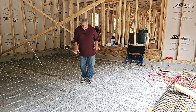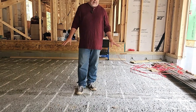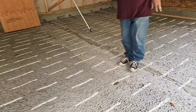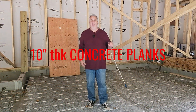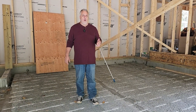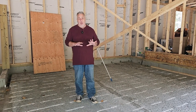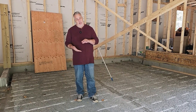You can see this is a very rough concrete. If your concrete guy gave you this as your garage floor, you'd fire him in a heartbeat. But that's because we're not quite done. You can see there's a seam here and a seam over there. This is basically a precast concrete plank that was cast somewhere — upstate New York, Pennsylvania, or New Hampshire — then trucked down here and set in place. We had eight panels make up the whole five car garage floor. These are precast panels, 10 inches thick. I have some videos of these things flying in, so go check them out.